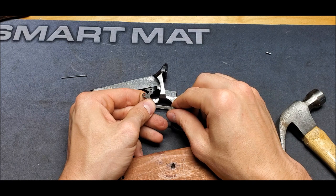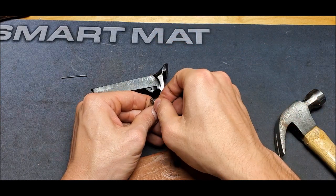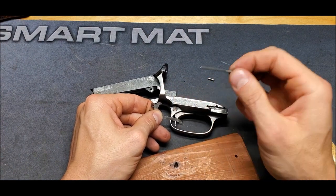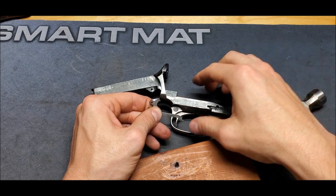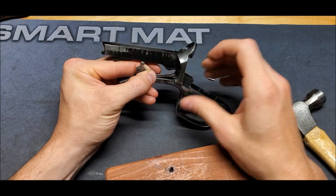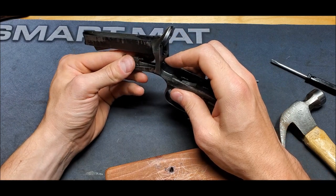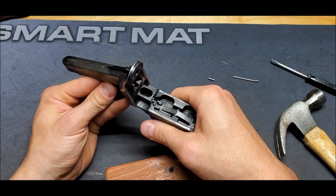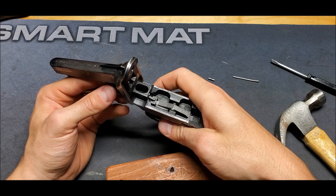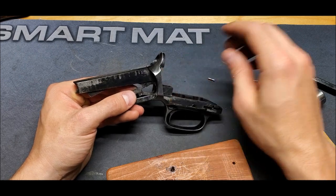And then while you do that and get it in the right position while maintaining the spring tension, you'll have to take your timing rod operating lever pin and push it through your timing rod operating lever and the placeholder. And sometimes you can use a placeholder pin like we did down here with the trigger. So, it's probably gonna be easier just to fold that spring afterwards. So just get your timing rod in first, pull the trigger up, let it slide down in there. And then when you let your trigger go, it is locked in place. It can't go anywhere.